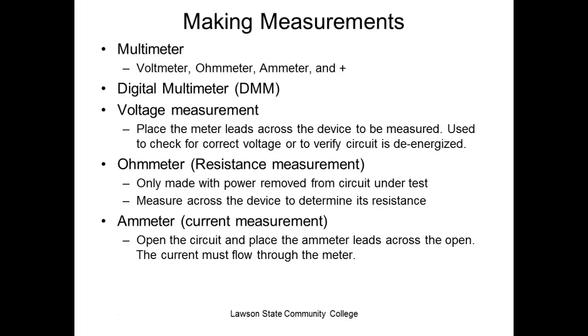Also, it'll give us a pressure source if power fails. So if your power fails and you've got to put something in a safe condition, you will still have a little hydraulic power, so you can do what? You can use these manual overrides to move that. So what are you supposed to do on that? Well, you're supposed to bleed off that accumulator, right? You understand? Or disconnect it. Some of them have a disconnect. Ohm meter, resistance.